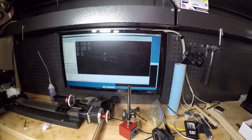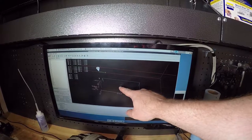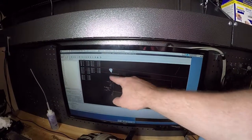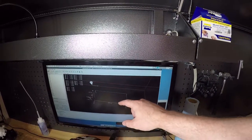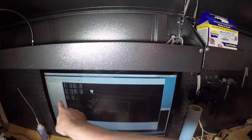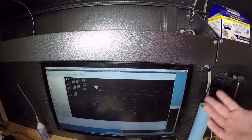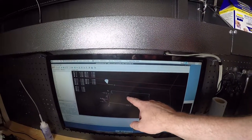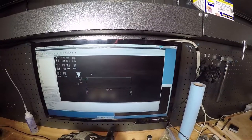Okay, we're back after spending an hour and a half trying to figure out how to move the origin. This was actually in the middle, which was driving me absolutely crazy. Even though my operation had it pinned up here in the corner, every time I would import into LinuxCNC, it would put it right back in the middle. The trick is that in Fusion 360, on the largest setup node in the tree, you have to set it there, and that's the main one. Maybe different software does different things, but LinuxCNC didn't seem to respect where I placed it.